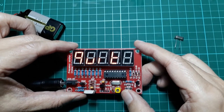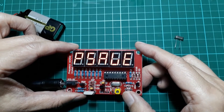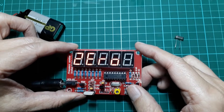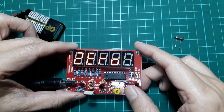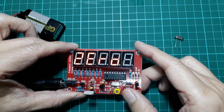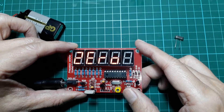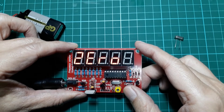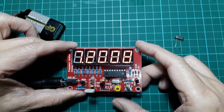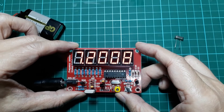To double check that, let's put in the 7.2 MHz crystal. You can see that now the frequency reads 17.2 MHz. We'll go back to the program mode and step through to zero.